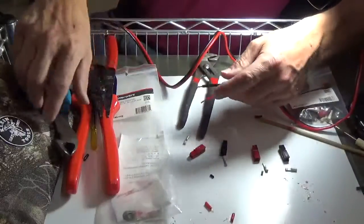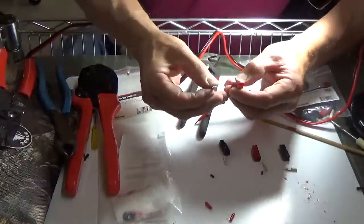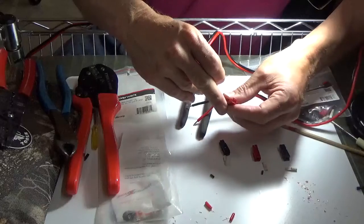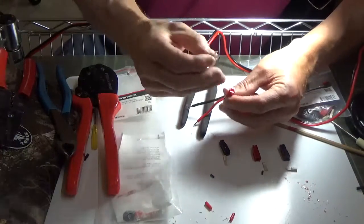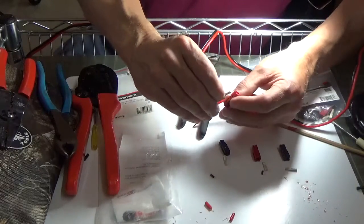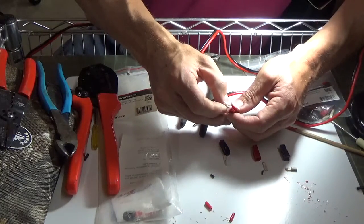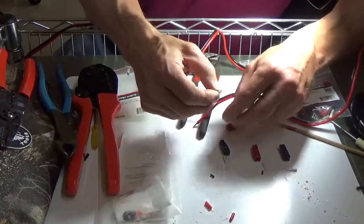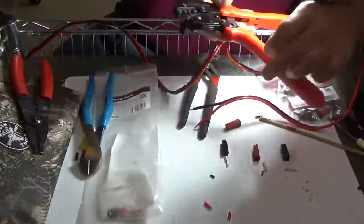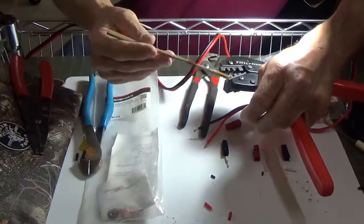So we got everything like we wanted. Let me explain this real quick — this is how this works. You see that piece of metal right there? It's on the bottom side. If I turn it around, it's on the top side now, but it's going to be on the bottom side. This little edge right here will actually insert directly into there. This lip right here is going to ride up on top of that piece of metal inside, so it kind of acts as a tension spring. Now the crimper actually has three settings — one of them is for 15 amp ferrules, 30 amp, and 45. We're using 30 today.